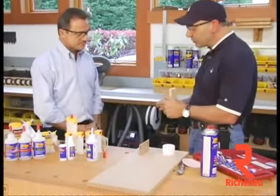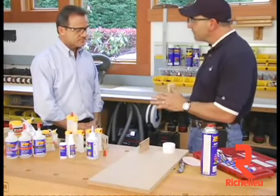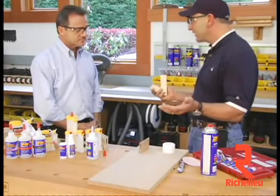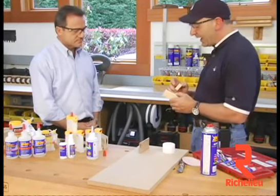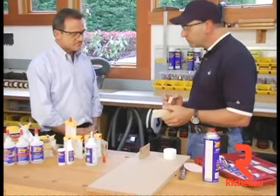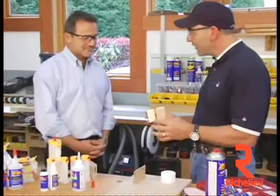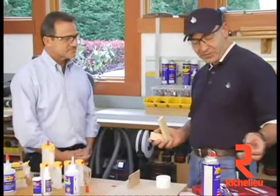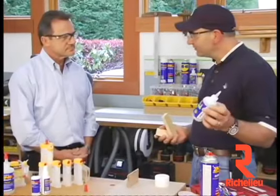Can you also put it together when it's still wet with the acetone? The answer is yes. It's better if you let it evaporate off, which takes a couple seconds, so it's no big deal. On the other hand, I can come back a half hour later and this glue will still be wet — it will not catalyze. So it's very stable, very easy. One of the unusual things about 2P10 that most people don't know is it has a two-year shelf life.